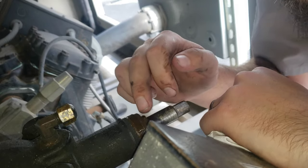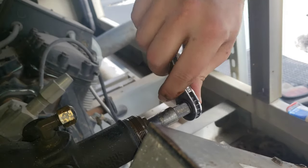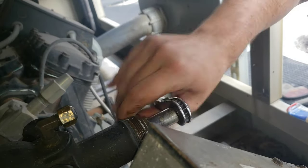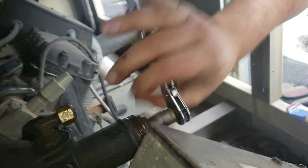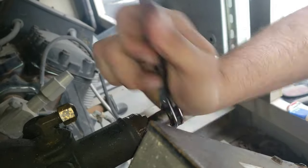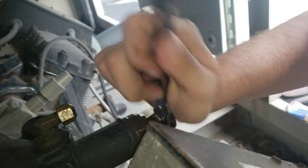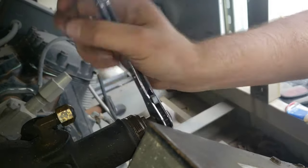You can tell people have been torquing down on the packing nut — I've got the nut all tore up trying to open the packing. One of the ways I know this is working is as I go, I can feel it getting easier to turn.